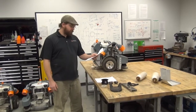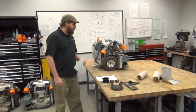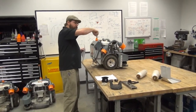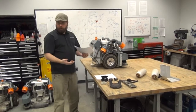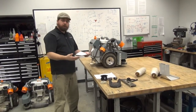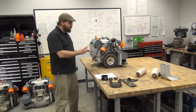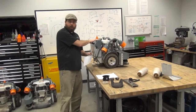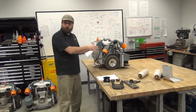The next calibration is the gyro calibration. The robot is going to look at the calibration fixture and rotate in both directions. It's going to create a table that corrects for the error in the gyro. There's no alignment for this — this is for a surface-mounted component on the card cage, so the calibration is all that's necessary.